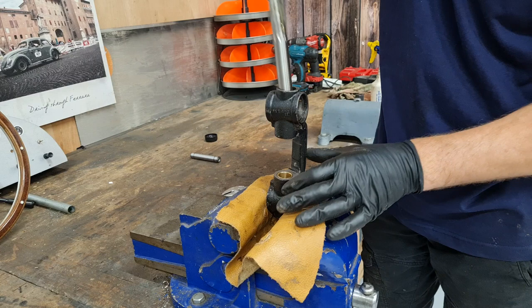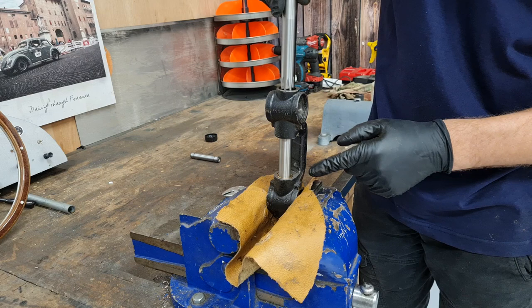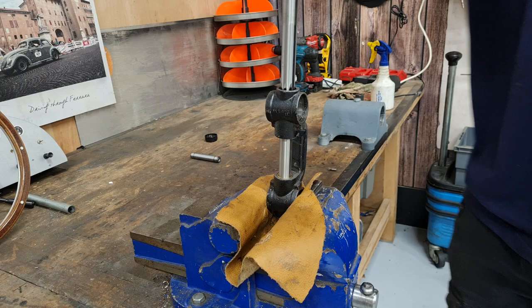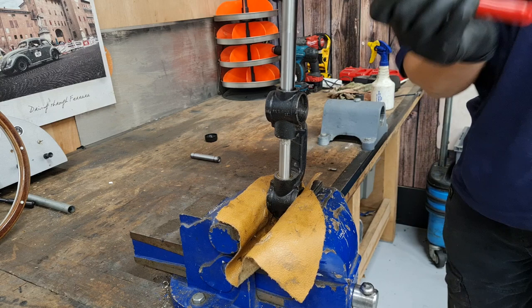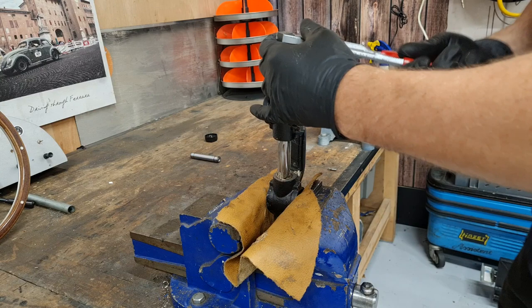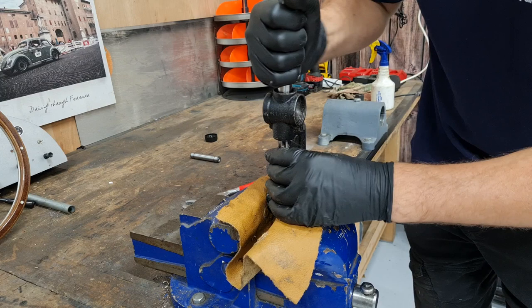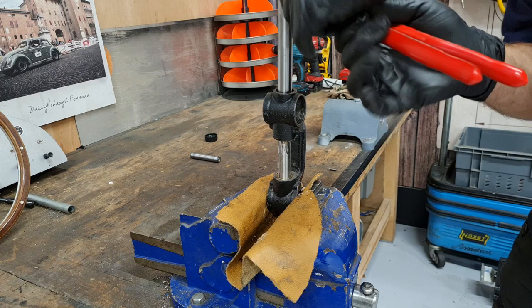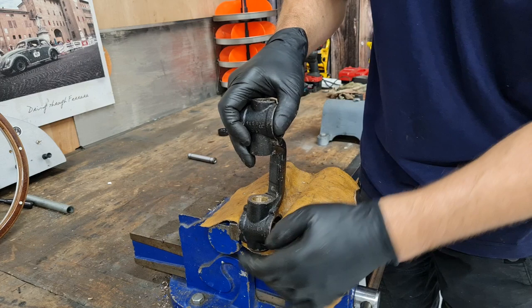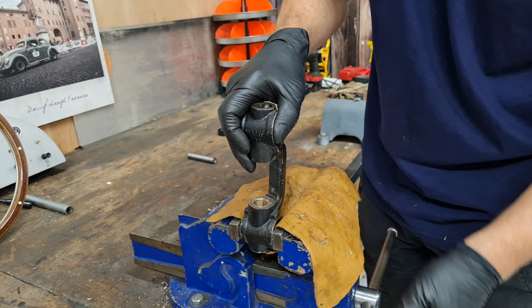I've got a bit of leather in the vice, and I'm going to put a little bit of cutting fluid on our reamer — or a little bit of oil if you haven't got cutting fluid, just something to take the friction away when we're cutting. The bottom part is slightly smaller than the cutter and acts as a guide. Using flat jaw pliers to get onto the drive side, I'm going to put a little bit of force down and ream through in one direction until we're through. It feels like it's cutting nicely. That's the first bush cut — I'm going to remove the material and gently withdraw the reamer backwards, in the opposite direction to which we cut.